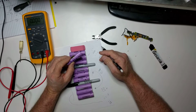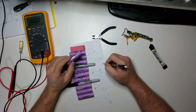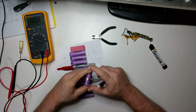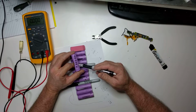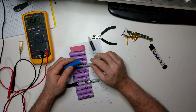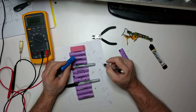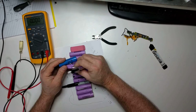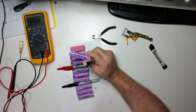And so your normal cell phone may charge at 0.5 amps or maybe 1 amp. It draws that much current through a battery. So if you have one of these in a small USB charger, it will only be able to charge at that current for maybe 2 hours. This particular battery, because it has a good amp hour rating. This other battery, the cruddy one, since it only has 0.375 amp hours, would only be able to charge at 1 amp for maybe 20 minutes or so, because the capacity just isn't there compared to this one. Like I said, these purple batteries out of these laptop packs are really good quality.